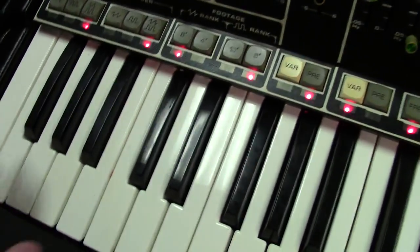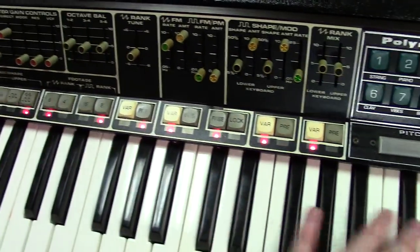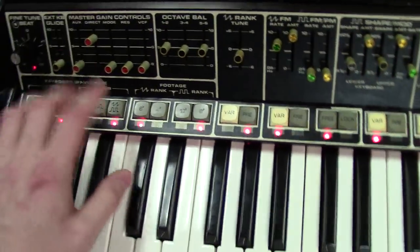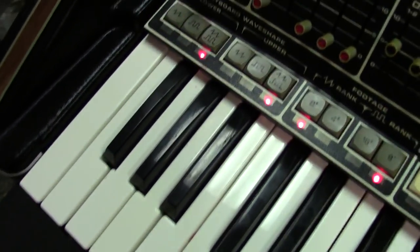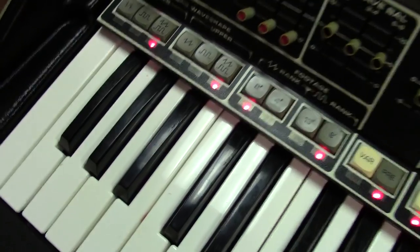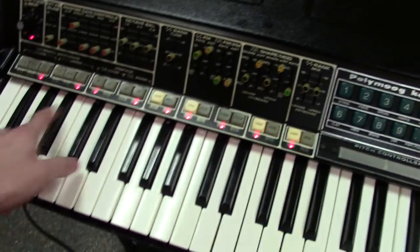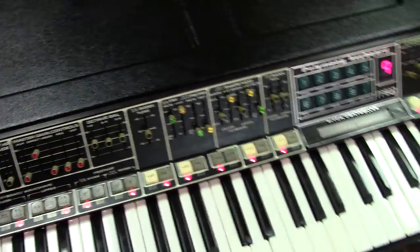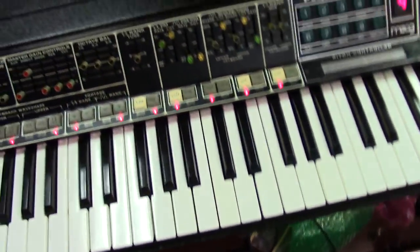One other note — this is something I want to bring up. Because whenever you see me working on these interfaces in any of my previous videos, I always put bubble wrap on the keys so the interface doesn't scratch them. Underneath the interface there are circuit boards with solder joints, which can actually tear up the plastic. Unfortunately, this Polymoog has seen interface work done without any protection on the keys. It scratches the tops of the black notes and you can see it. There's not much you can do for that — somebody just didn't really care. And that's a good indication it's been worked on before. That's why you always see me use bubble wrap in past videos, and it's something I still do — I've got a roll right there I pull out when doing interface work.